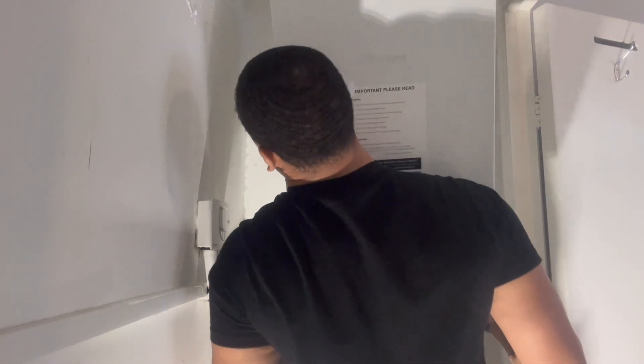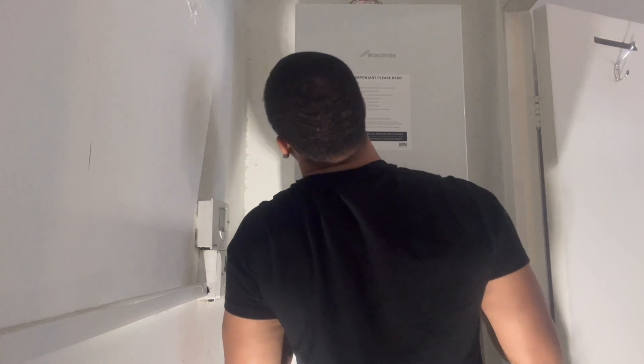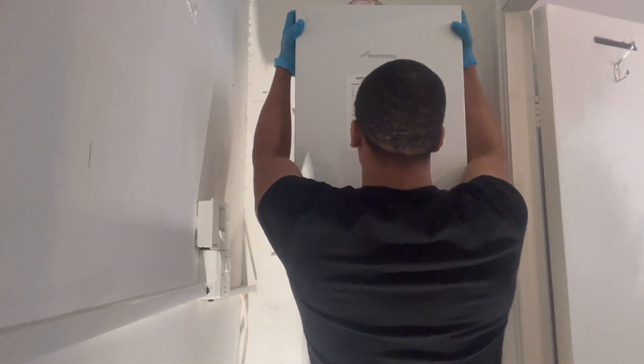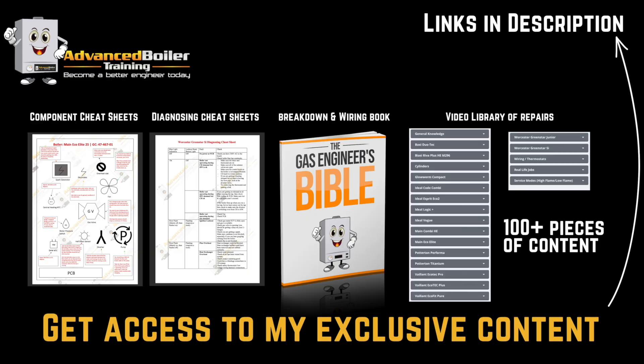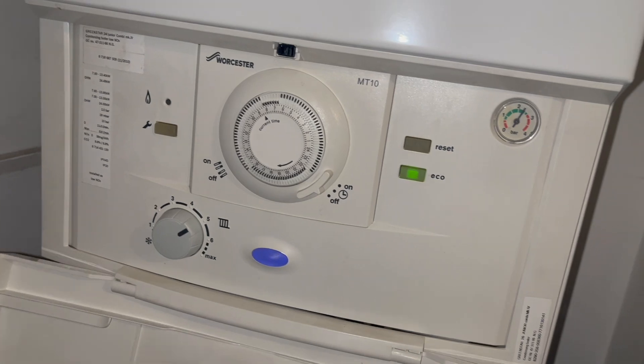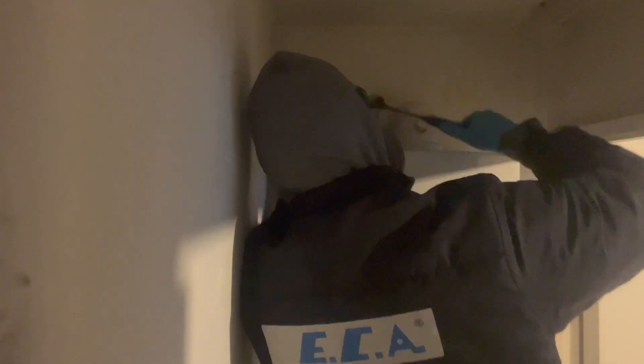In this video I'm going to show you the entire process of installing a brand new boiler. We'll start with taking the old boiler off, throwing the new boiler on, doing all the pipe work and everything involved. This is the boiler we're taking out — it's a Worcester Junior — and the customers aren't happy with it, they said it's not working properly and they want to upgrade. First thing we're going to do is our safety checks: make sure the ECV isn't bypassing and make sure there's no gas leaking.